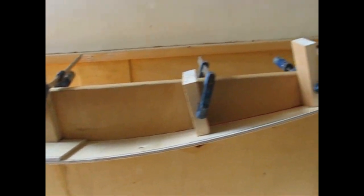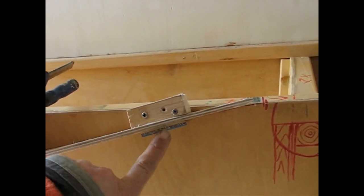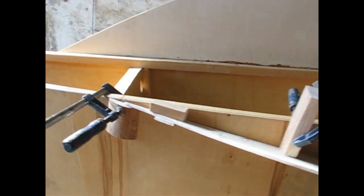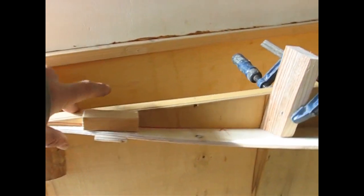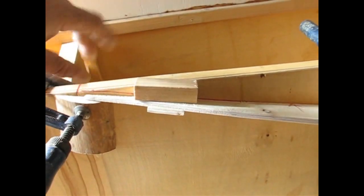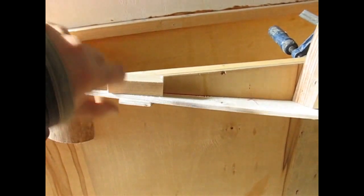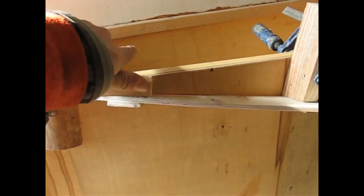You've got the front, and this is the only problematic one. You screw it in on the bottom first and catch a block. You'll have to shape that block — you can use a block plane, sandpaper, a file, whatever you want. Once you've shaped it, the end is a wobbly one — he's problematic. Once you've shaped it and screwed this thing on, you drill a hole, because with small pieces of wood you must always pre-drill a little. Then you'll find exactly where you want it and hold it up to screw it into the gunnel.